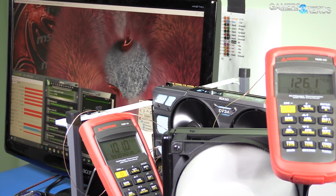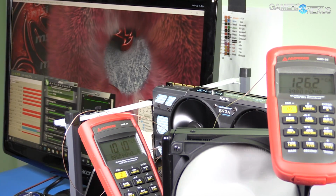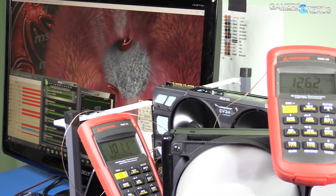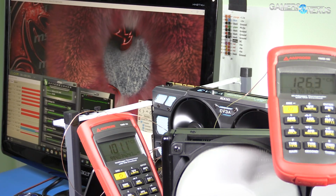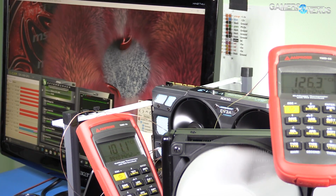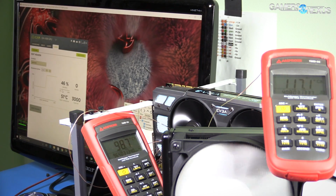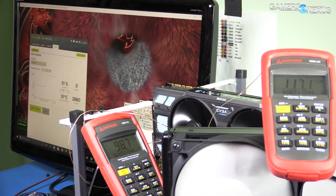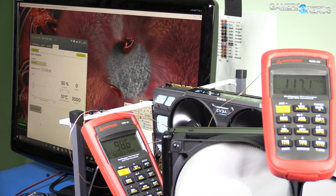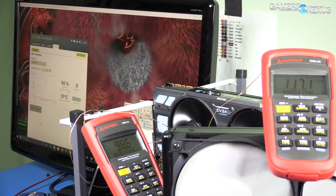It's a lot. This is more than just a simulation of a high ambient case temperature. It's actually worse than that because it's directed airflow, not just sort of sitting air. The effective temperature that the card was breathing was often 40 Celsius of pure heat from another source of heat, which is the CPU. And I even lowered the fan RPM on the EVGA card to 50%, provided 30% more power, overvolted it 100% of allowance, and overclocked it by 125 megahertz.